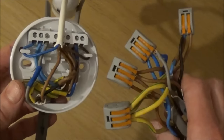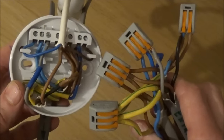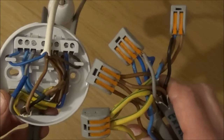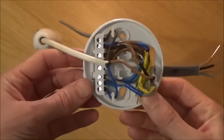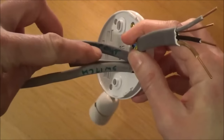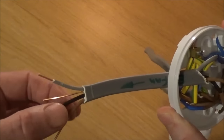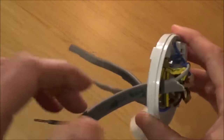Now I'm going to show you two practical examples — using a traditional ceiling rose and using a more modern Wago 222 connector block. For more specific detail on how to wire a lighting circuit, watch my other video: how to fit a ceiling light, lighting circuits explained. First up, with the traditional ceiling rose, I've labelled the cables just like in the diagram: loop in, loop out, switch, and then the three core and earth cable that goes to the fan — you've got your three sheathed cables and the bare cable covered with the earth sleeve.